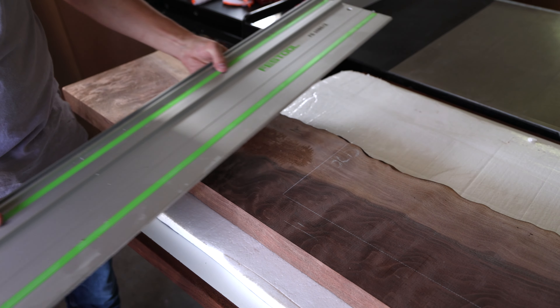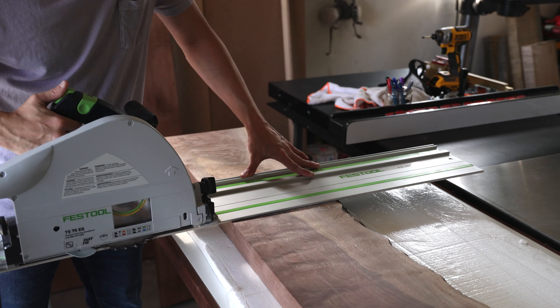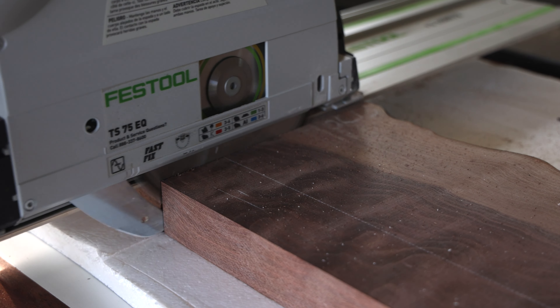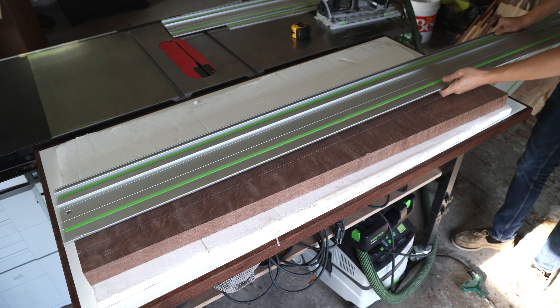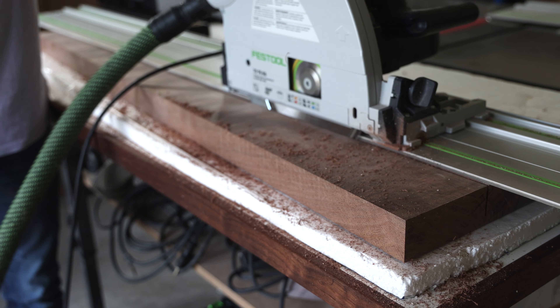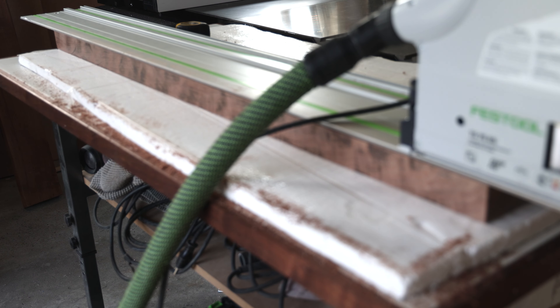Up to this point, what I've done is determined the layout for a coffee table sized at 49 by 21 inches. After marking out the rough lines with a scrap plywood template, I'm using the Festool TS-75 track saw to cut the slabs to size. Although this track saw is incredibly accurate and quite powerful, cutting the slabs to size in one pass usually causes binding and burning. Whenever I use the track saw, I take on average three to five passes to get through a piece.